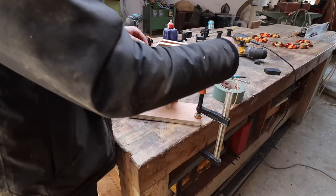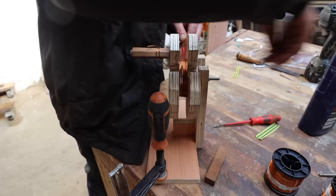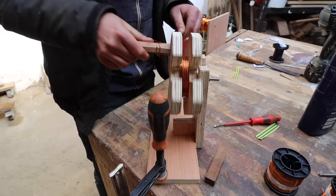Yeah, just winding the coils, so I'll get one wound with you. So just do it like that, out of the way. You start out trying to keep these all in line and all perfect and back and forward and over itself, but it just doesn't work. So I'll just give up in the end. It all gets cast in resin anyway. Just wind it on there basically. Just trying to keep an even tension. Yeah, 150 turns.